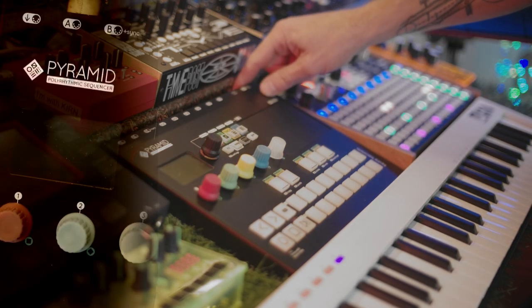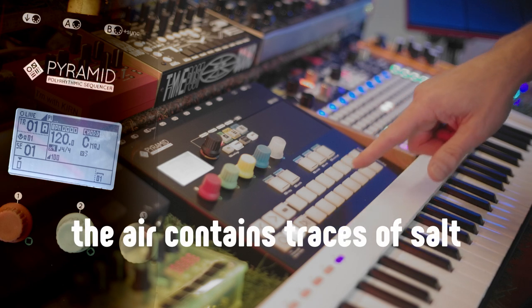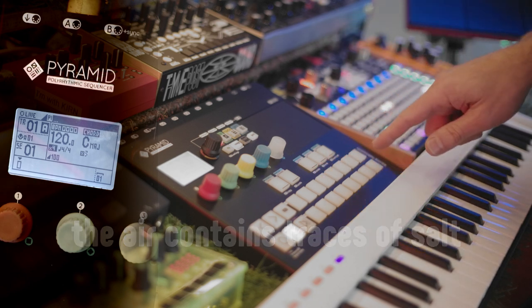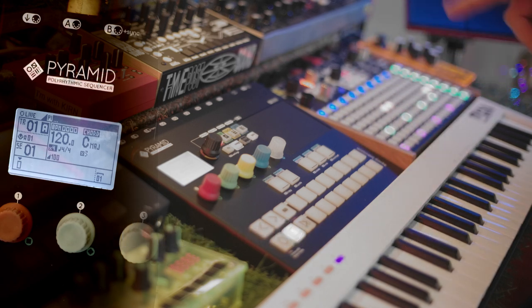So let me just turn it off and on. What I think is happening is that there's dust or something oxidized in the contacts on the pad, and the pads are actually registering multiple times — they're bouncing or something like that — because of what I've noticed following.